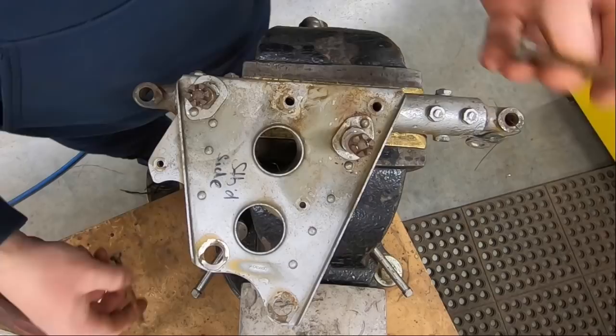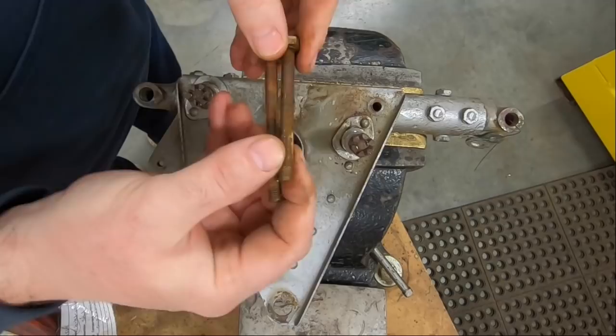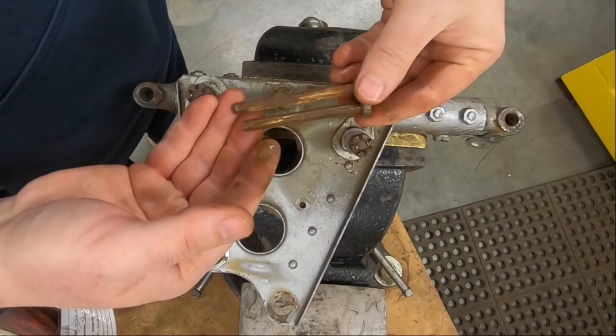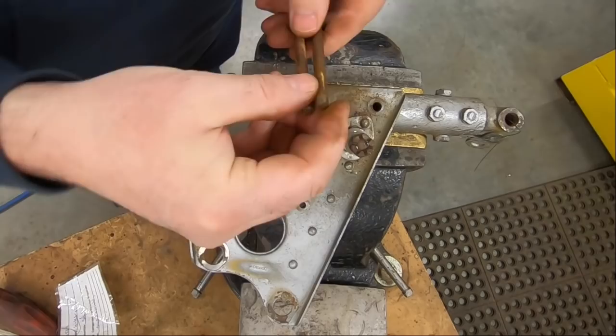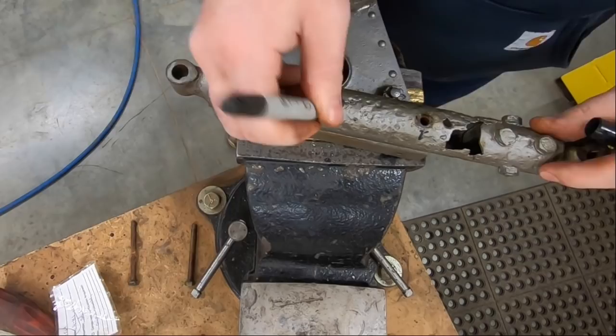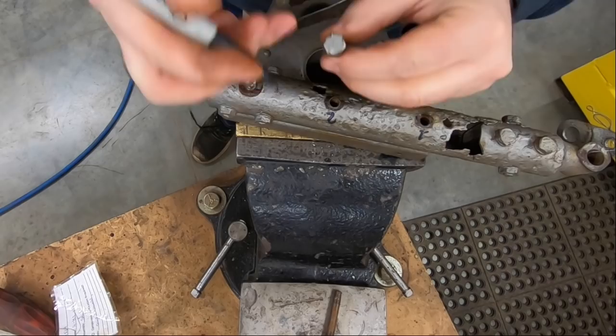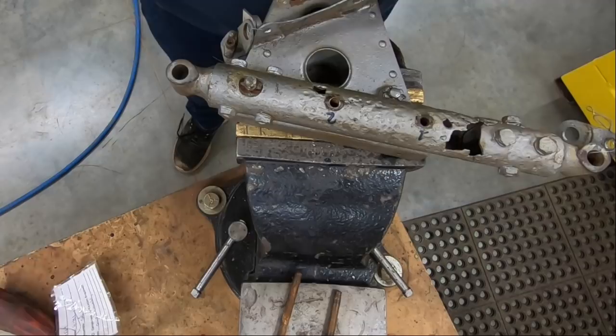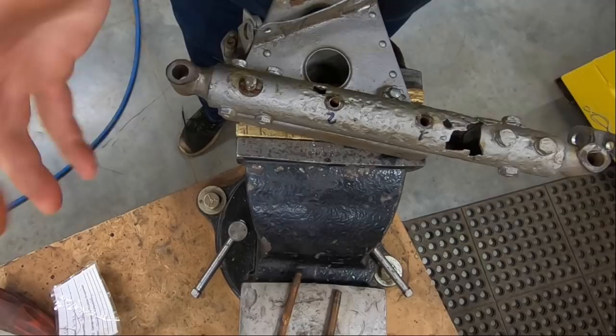Well, it's still there. I just want to make sure that these are the same. They're not. That's one thing I've found throughout this aircraft, is that because of all the different shims and little packing pieces, quite often bolts side by side have different lengths on them, and that's because there's so many little things that are attached. So make sure they go back the way they were. So this is just temporary, but it's so I don't lose track of what I've done here. And then I'll bag them and tag them to the specific hole that they came from so they don't get all mixed up.